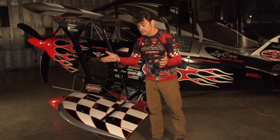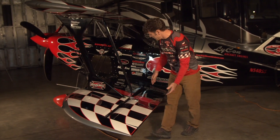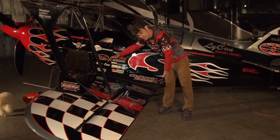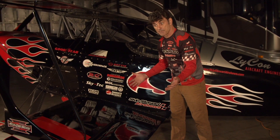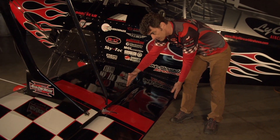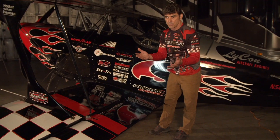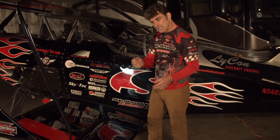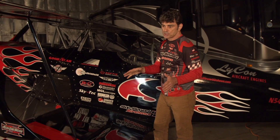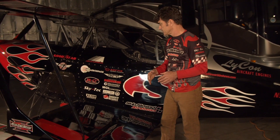In order to get the roll rate we want — like a clipped wing airplane — but keep the wing area, we reduced all the wing tip area. There's very little wing tip area, but at the root the wing is actually stretched. It's about six or eight inches wider chord than a stock Pitts, so the overall effect is 13 more square feet of wing area. All that extra width is behind the spar, so it all becomes aileron. These ailerons are huge — P1 has two-and-a-half to three times the aileron size of a stock Pitts, and this one is about 50% larger than that. They roll really fast but also pull corners really well — I can do my entire show in the same space and pull two or three less G's than I do with P1.